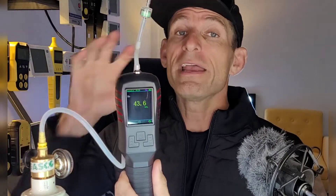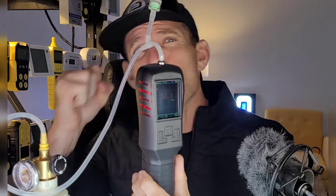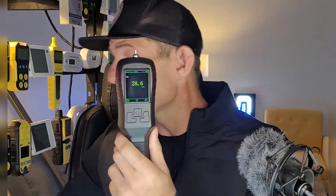I'm going to give you a quick demonstration of its accuracy. I've got a 50% calibration gas bottle right over here. We're going to pop on the pump and squeeze out some gas, and you're going to see how fast it measures in real time. It has internal alarms that are adjustable. And — bang! — 50.3% right on the mark. Our gas mixture certificate was 50.22, and this gets it right on the mark. I don't think Dr. Koz has ever built a more accurate gas analyser than this one. Very, very accurate — the specifications speak for themselves, and in fact it's more accurate than the specs. The specifications represent worst-case scenario.